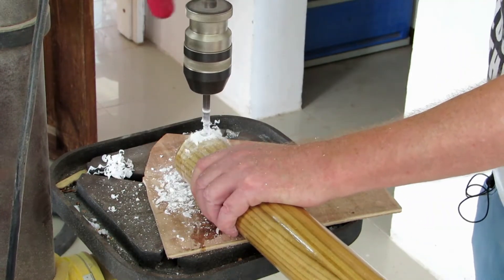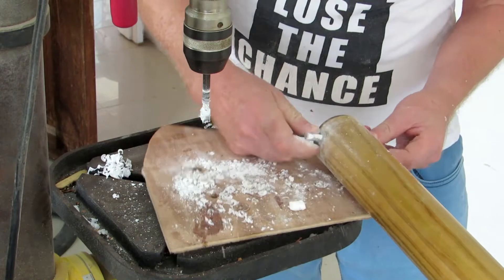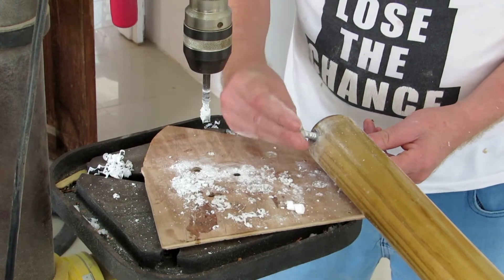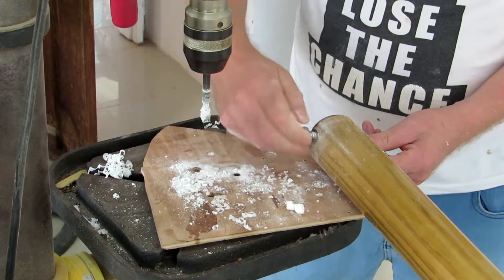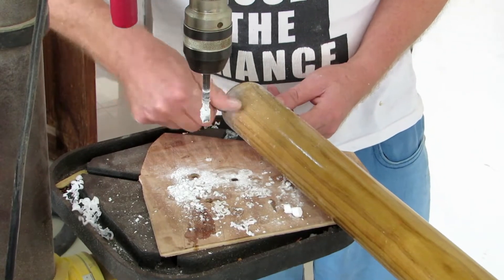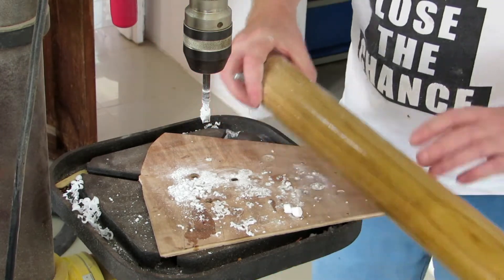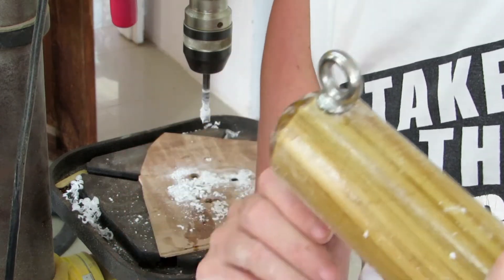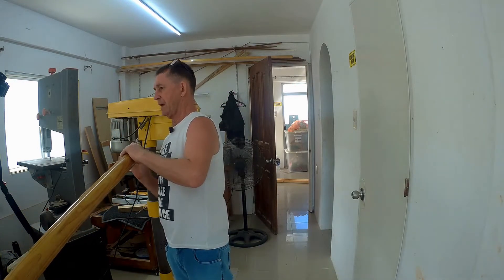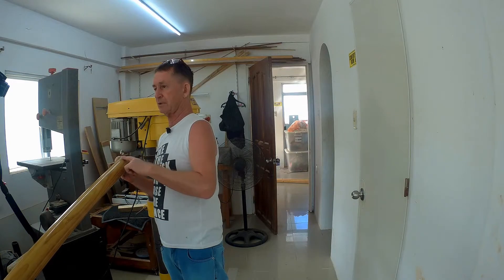Nice and powdery. This is stainless steel, 316. If you can get 316 when you're doing stuff on the boat, try and get 316 rather than 304, but sometimes when you're buying online you can't get what you want. I'm going to take this out again — I don't need to put silicone or anything in here because there's nothing in contact with wood; we've drilled through just the epoxy. I've made my dead eye and I'm going to put my pulley on it, a spring washer on the back, and stainless steel nuts with the plastic insert so they won't come undone.